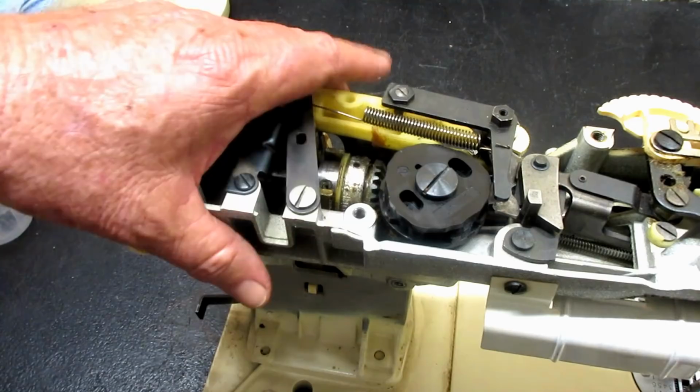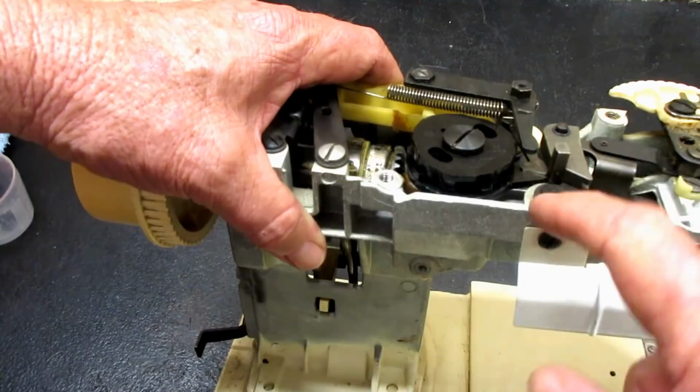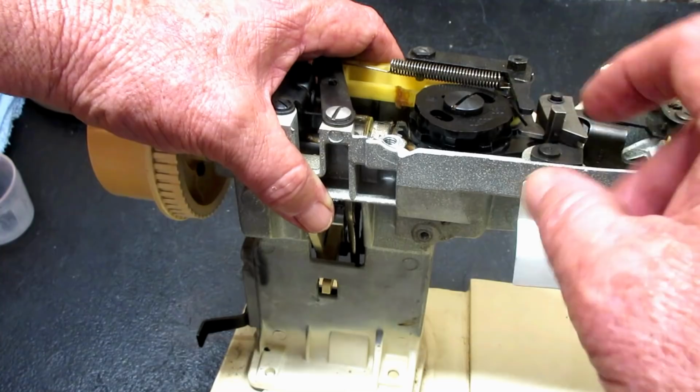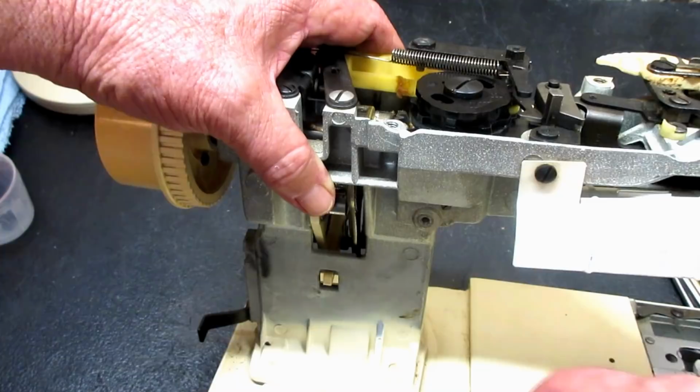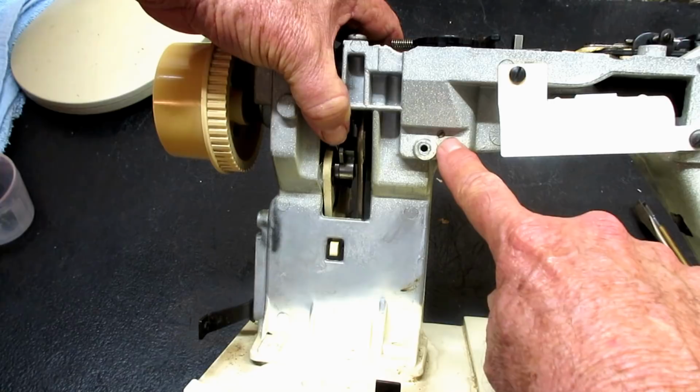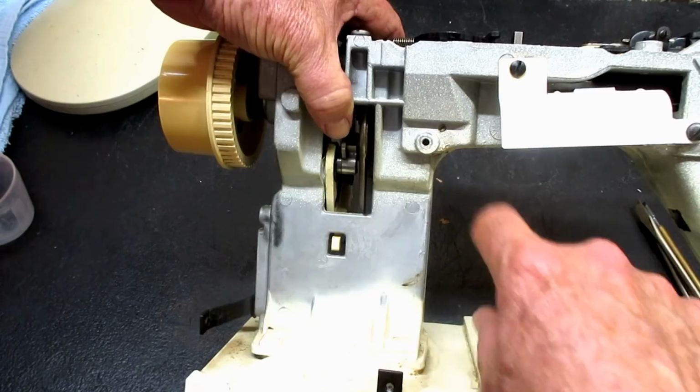And many Singer machines I've worked on have this. And the big thing is, when you're removing it, to keep that cam follower or pattern follower, whatever they called it, on the machine, away from the cam stack, so that you don't bend it or damage it while you're pulling it out. On this machine, the set screw that holds the cam shaft of the cam stack is down here. Okay, you see there's a little set screw